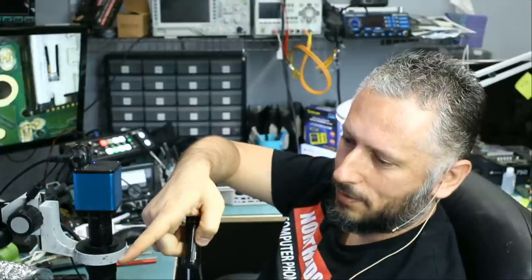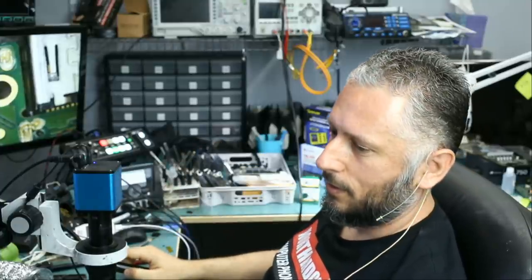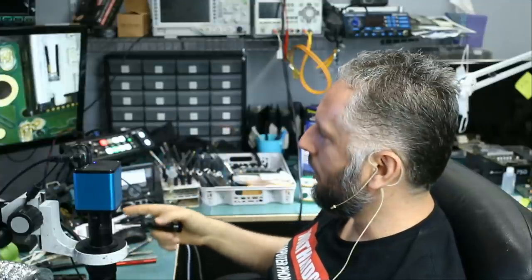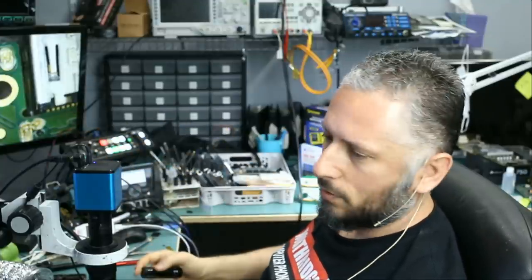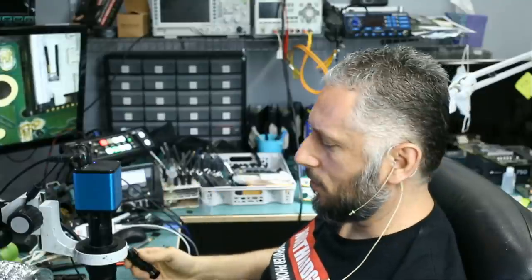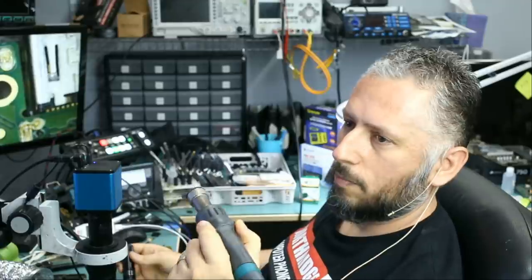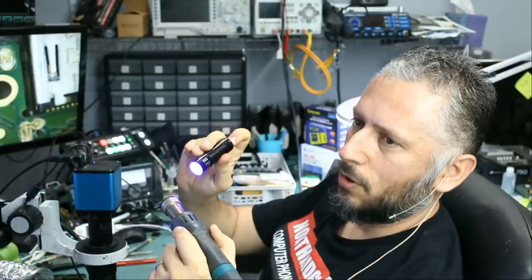I currently have my hot air station set at 380 degrees Celsius. You do not want to go 400, 450 or 500 because you may end up liquefying solder on the board. So maybe a 350 temperature is good. I currently have my hot air station at 380. So you apply hot air and UV light, both.